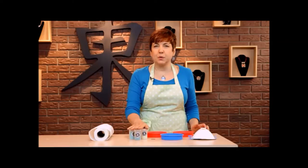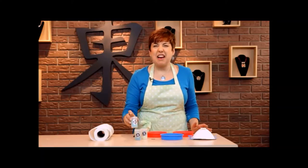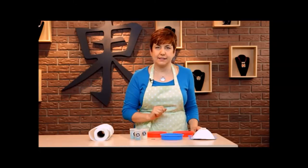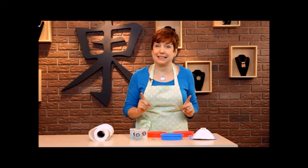When you buy enamels, it's going to be called 80 mesh enamel, and that's what that means — it's been through the screen. You get everything that goes through 80 mesh, from the 80 mesh sized particles all the way down to the finest dust. That really fine dust is called fines — that's an actual enameling term.